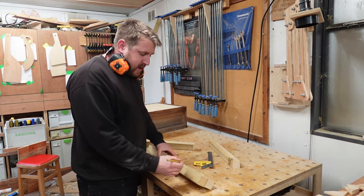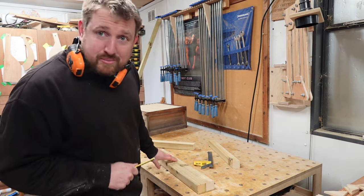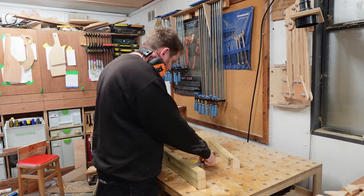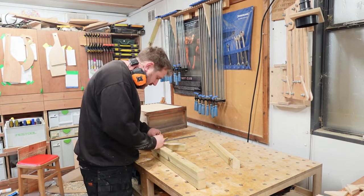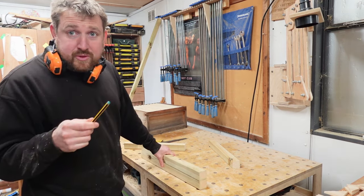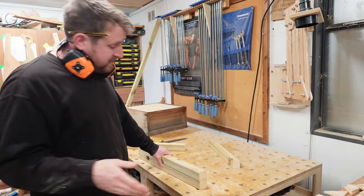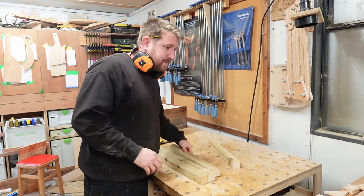like that, and then that can slope off. Then we'll have a nice big slope, and that can be for our flight boards. So we want the depth set for that. So half of 44, 22. There's two ways we can go at this. We can go at it with the bandsaw, or we can just use the mitre saw, make lots of choppings, and then knock it out afterwards, which I think is what we'll do. It's fairly easy to do.